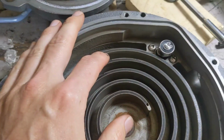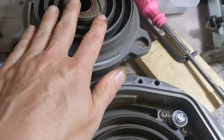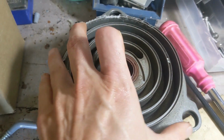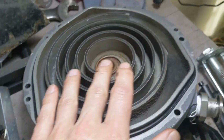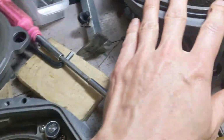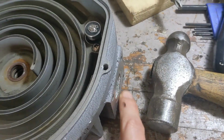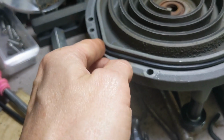If I were just doing the regular tip seal maintenance, that involves this little O-ring right here, the tip seals themselves, there's 4, the shaft seals, one on each side in there, and a big shaft seal on each side of this. So there are 2 big shaft seals and 2 little shaft seals with the tip seals, and some O-rings. There's an O-ring included for the input, which is missing from this. The manufacturer includes an O-ring for that, and for all these other things as well.